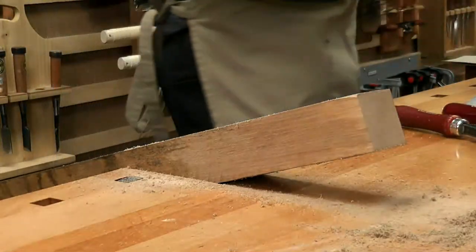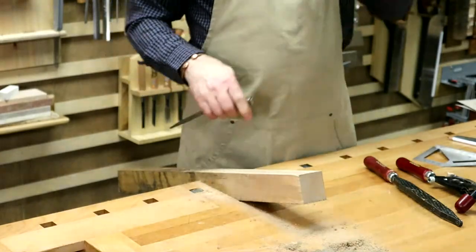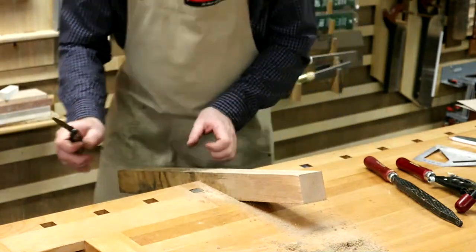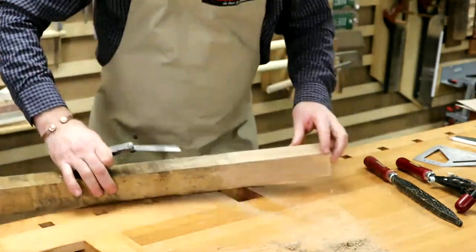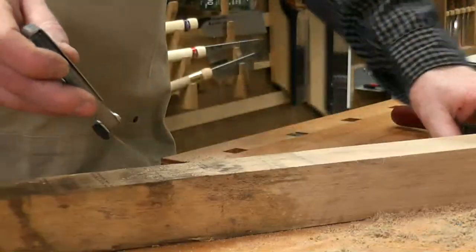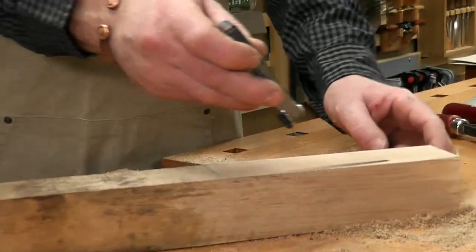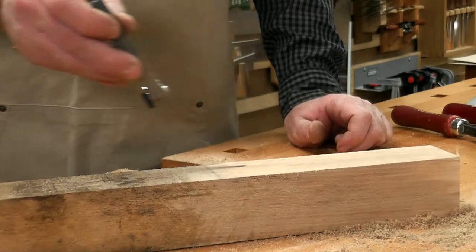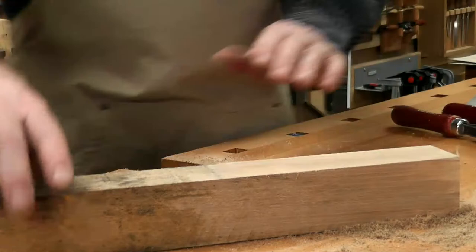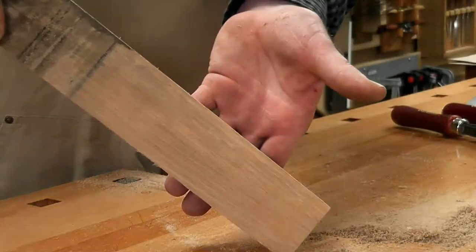Okay, we've covered all our board. I'm trying to figure out earlier a way of showing you how this gives you a finish. Okay, this is a 0.1 feeler gauge. If I go down the bit we haven't touched, you can see it digs in. If I come up to here, that's dead smooth. Really good. That's quite amazing. For something that actually looks quite brutal to use, it will give me clean finish straight off. Nice clean grain. I think you can probably see.